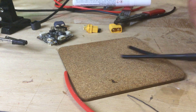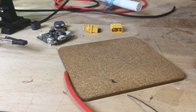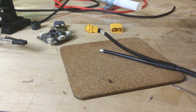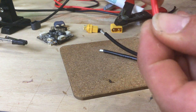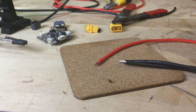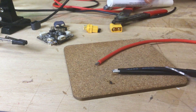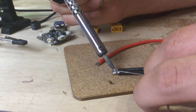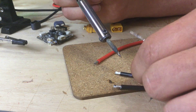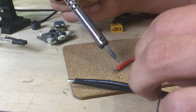That's the red wire. I'll quickly do the red wire as well. So all I've done is just strip the ends off the wires and now I'm going to go and pre-tin them. That basically means we're just going to give it a nice good dose of solder, so that when we get round to soldering it on the actual board itself, it just makes it as easy as just heating it up and then it connects. You would have seen in a previous episode I've already been in pre-tinning the board as well on the pads themselves. So let's just get in there — fill it up with loads and loads of solder.